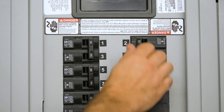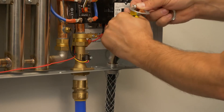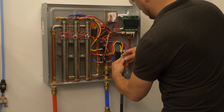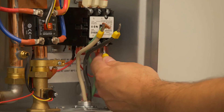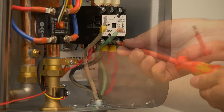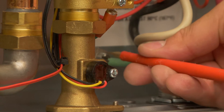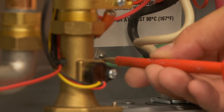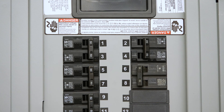Before starting the electrical installation, review the electrical specifications and ensure that all power is off. Install electrical wiring and make internal connections to the heater as required. You must use the appropriate wiring for your specific unit. Use the appropriate strain relief fitting. Check the electrical connections to make sure they're correct and that all wire connections are tight and secure. The ground lead is to be secured to the GND connector on the grounding block. Confirm that the correct breaker size and wire gauge has been used. Leave the circuit breaker off as we go to the next step.